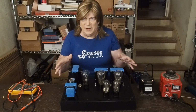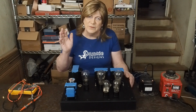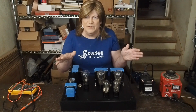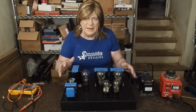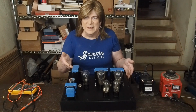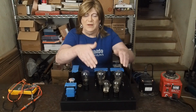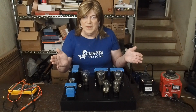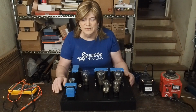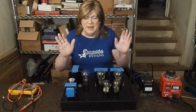I do have a pair right now that I think one of them's at 2.45 and one of them's 2.55, so I can live with that. But they're 2 different brands, which I don't like because they look a little different. That'll be good enough for testing. And once I determine that these 27 tubes will work driving these 47s, I can worry about finding a nice matched pair. So we're going to stop fretting on that.